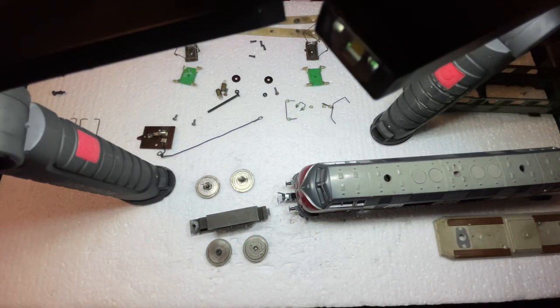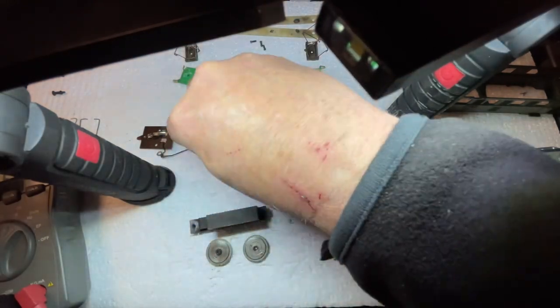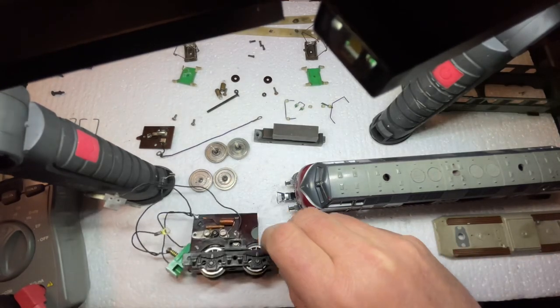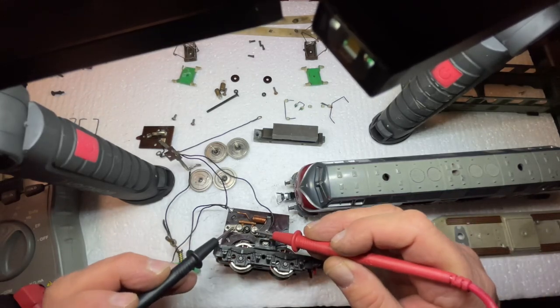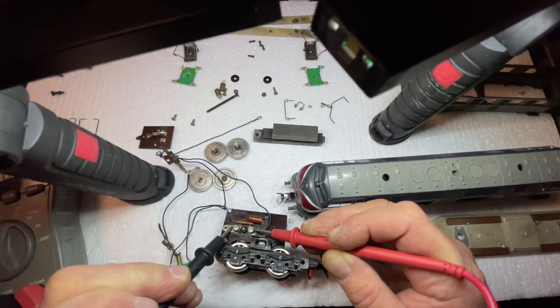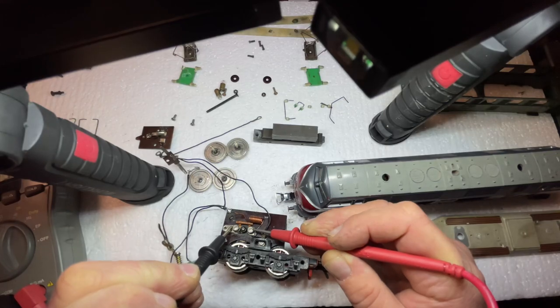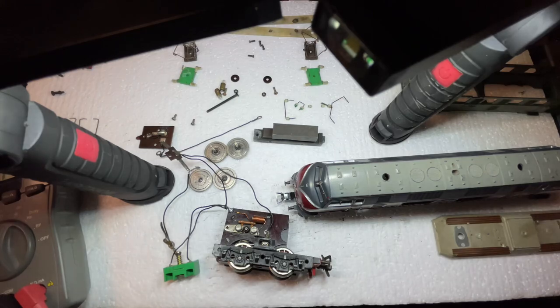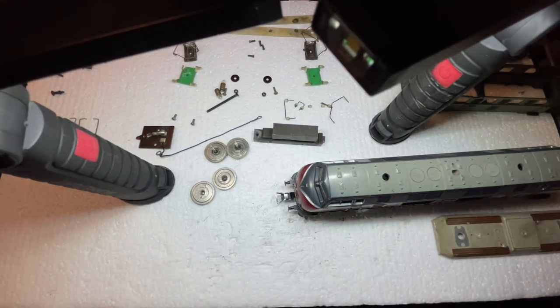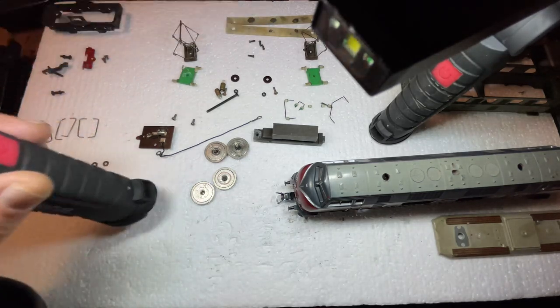You always have to check this. On most multimeters, the continuity test will show continuity for anything less than around 30 ohms. So if I take the motor and test it, we hear continuity — but when we measure the actual resistance, we find it's 30 to 40 ohms. My meter looks at everything 50 ohms or below as continuity. What we're really looking for when testing wheels is anything less than one ohm; otherwise we might be measuring the motor and getting a false reading.